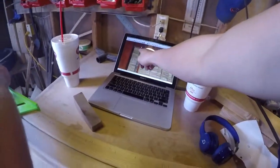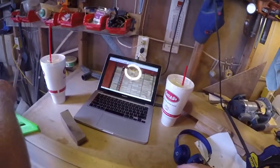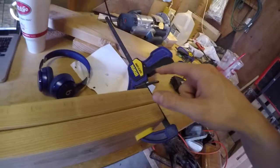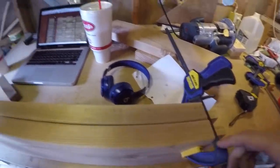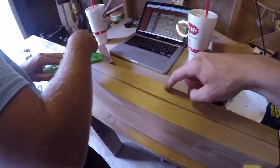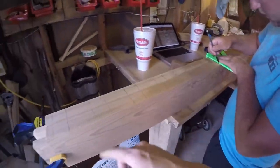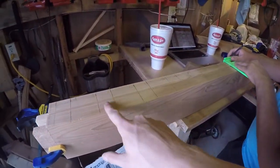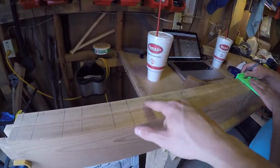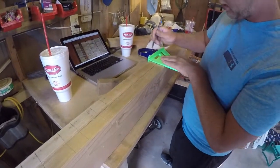What we're going to do is cut a half-inch notch out of the slat so that there is somewhat of a mortise and tenon there, to hide some of the rough work that the chisel is going to do. We marked out where the whole slat was, then went back and took off a half inch on the inside of the slats — that's where we're going to router in between. Caleb is marking these here. The lines in between are where we'll take the router and cut just a slot in the center, so the slats will slide right down into them and everything will look very nice.